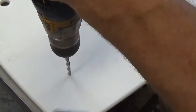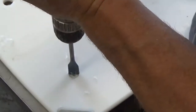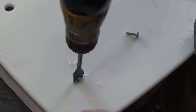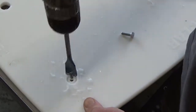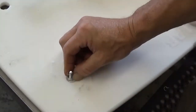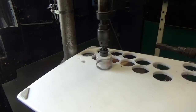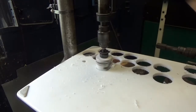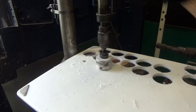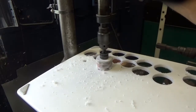I'm just going to start by making a quarter inch hole - that'll make it easier for this kind of bit to give me my recess. I have this drill press set to a slow speed and I'm gently going to go through until it breaks through. This cutting board is approximately half inch thick.